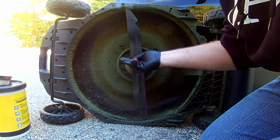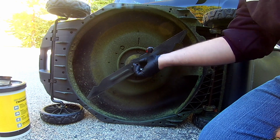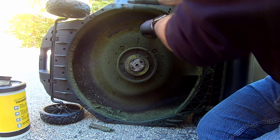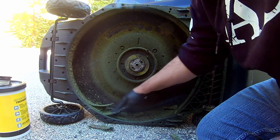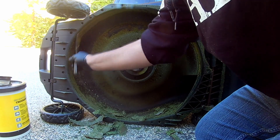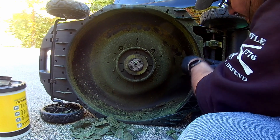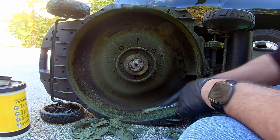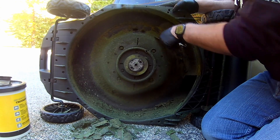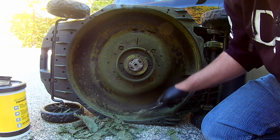You can see here I let this get caked up pretty good — I did a little neglecting for the video. Cleaning this up can really be a pain, so you want to stay on top of it. You can use a Teflon spray to keep grass from sticking, but you really want to clean it off after every use. You'll need a 14-millimeter socket, a scraper, and some heavy-duty clean wipes so you can get things wet and loosen debris. Continue scraping and cleaning — this will prevent resistance from the blade tossing clippings into the bag.